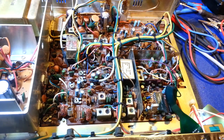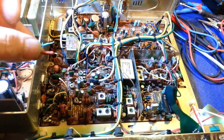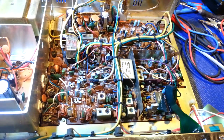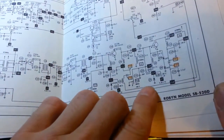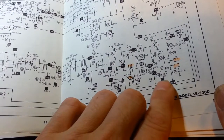So like I said, I get to checking a few things, and I pull this resistor. This resistor is the one that hooks up to the 8-volt transmit rail to supply voltage to the base of the final transistor. Let me grab the schematic. This thing cracked open here. Okay, so I pulled R180 right there. You can see 8.2 volts in transmit.